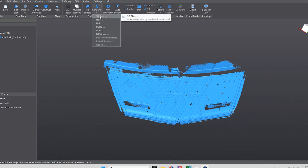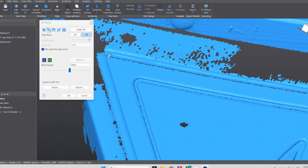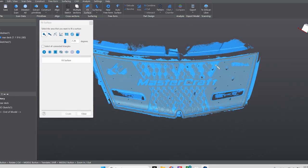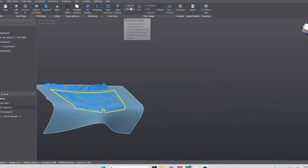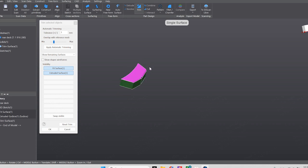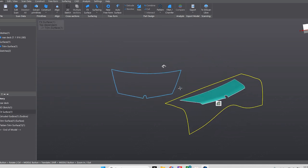We're going to use the outside outline feature to project the outer profile onto a 2D sketch based on where our plane is, then generate that sketch into something we can pull into a CAD file. If you want to do most of the CAD from within XModel itself, you can use the 3D sketch function to snap onto the mesh nodes, create a 3D sketch, and generate a surface fill to follow the surface. We then project our sketch onto a plane, extrude a surface, use a surface trim to create a perfect replica, and simply flatten it using the flatten function. It's that easy.